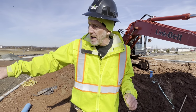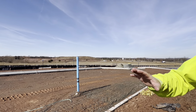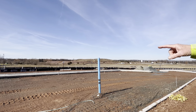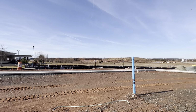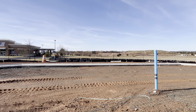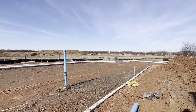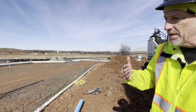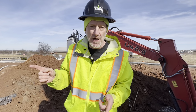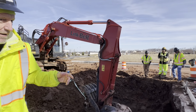Once that's in, I have subgrade here now, and no snow, so that's good. It's graded so it all drains, and so it can dry quickly. And then from the gutter line, we're -10, so my road section is coming up right now: stone, then 3 inches of asphalt base. And once we get into that asphalt base, I have no concern or worries at all about mud and dirt getting on the road. And at the end of the job, we'll come in and put a 1.5 inch top coat of asphalt on, at the very end. So that's kind of what's going on out here.